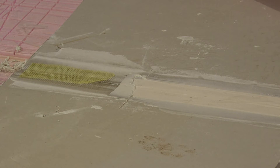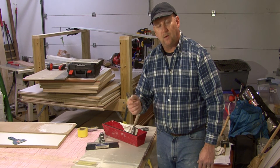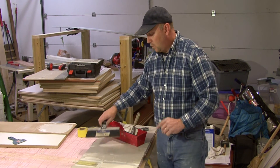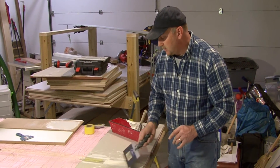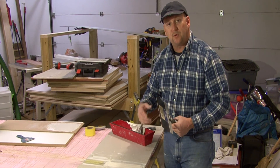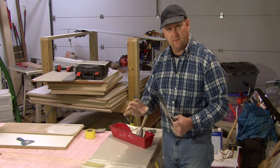Then, once that's done, the last coat we're going to put on thick with a watered-down version of it, and then let that dry a little bit. While it's still somewhat wet, we're going to take a knife and just knock down that finish so it matches the rest of the texture or knockdown. Now, if it's a popcorn texture or something like that, then you can buy small cans of spray-on to fix those areas.